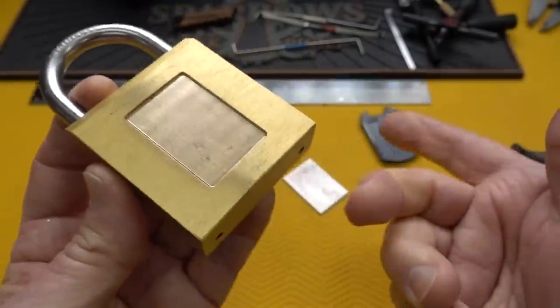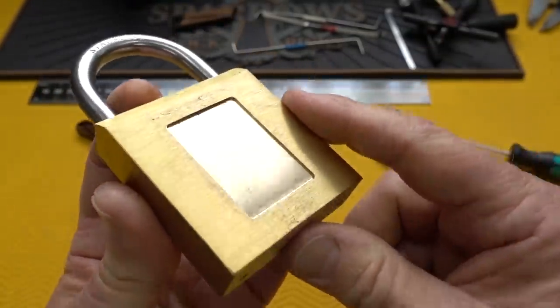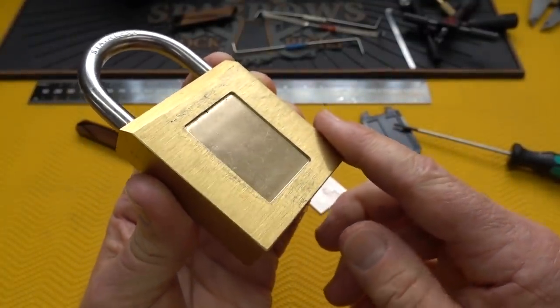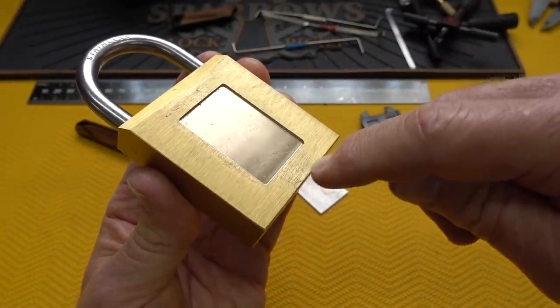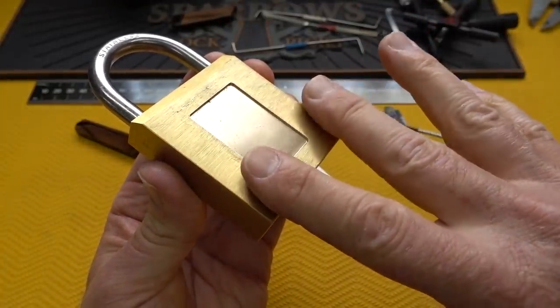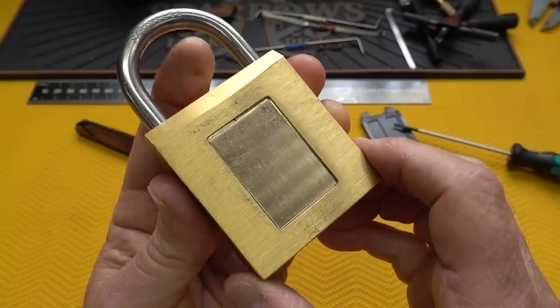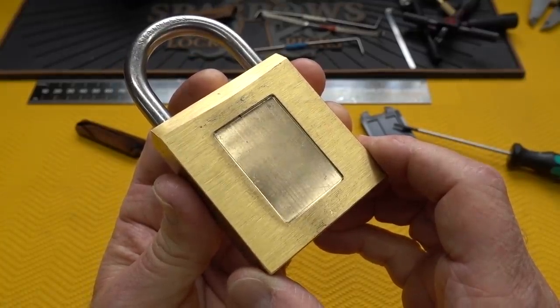So here's what we're going to try to do. We know how the magnet works and what we're expecting. I want to know how the lock and unlock mechanism works. So I'm going to put this in a milling machine, cut it around the perimeter, and try to remove the whole plate in its entirety without disturbing the innards so we can get a nice close look.